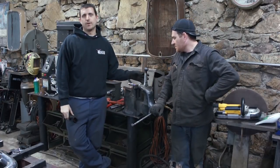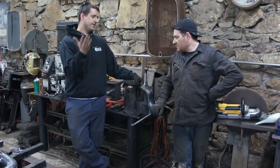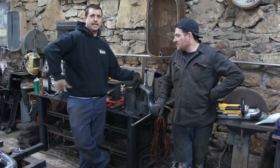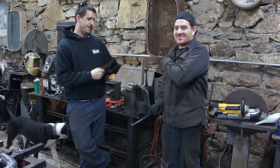So we're gonna fire up the flame wrench. We're gonna heat the arm up and add about 5 degrees of a bend to it, and then let it cool and heat it up again, and then bend it 5 degrees back, so then we have a nice step in it, it's flat, and it won't rub the cowl when we're turning lock to lock. So try not to catch ourselves on fire.